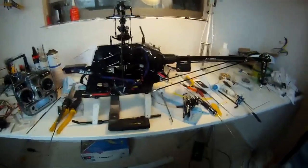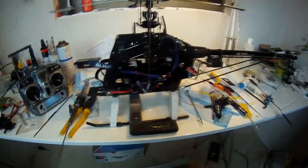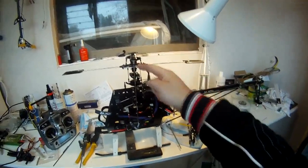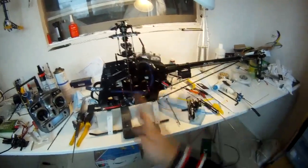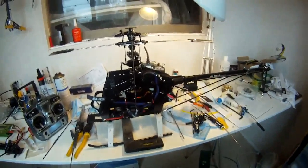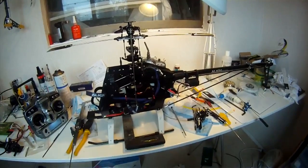That's quite a lot out. It's facing back that way a fraction — two millimeters — so we need to lengthen this shaft here by roughly two millimeters, probably a little less, to get it to come straight. I'm going to take this off and lengthen it a turn, maybe two turns. I'll do one turn and see how it goes.